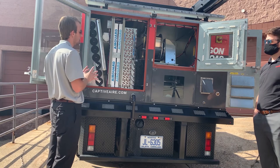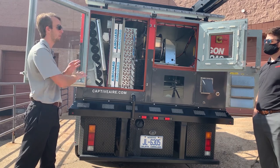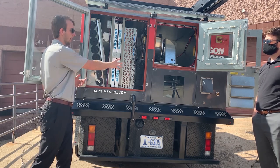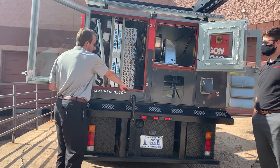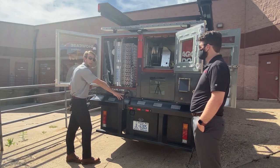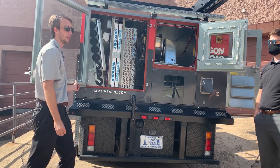We'll talk about how we modulate with our compressor on the other side of the unit. On this side we have our electronic expansion valve, which allows us to precisely control our superheat — making sure superheat is optimal for outdoor air temperature and the load we're encountering. It also allows us to reverse the cycle and operate as a heat pump to heat during shoulder seasons when we don't want to turn on the burner. When removing condensation, we have a stainless steel drain pan with a factory-mounted float switch. If condensation backs up, a fault alerts us and can be texted or emailed to the building manager via our CAS link system.